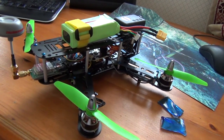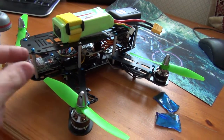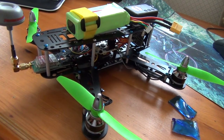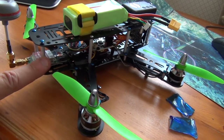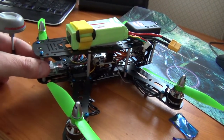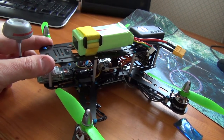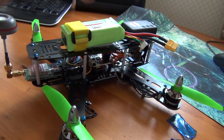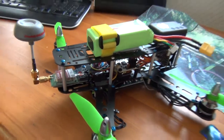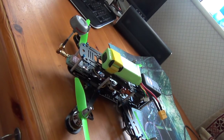Some of the screws are always too small and the material is dead soft - that post there is cross-threaded. I tried to use a different screw because I already broke one, and I've cross-threaded this standoff. I do have a spare from one of my other Flip FPV machines that looks the same height, so I'll sort that out when I take it apart. The video transmitter could maybe have sat on the top deck - that would have been even better for battery location. Right, so there we go - next video of this is either with it in the air or in a tree. You just never know.